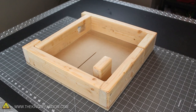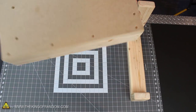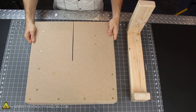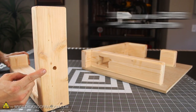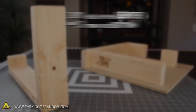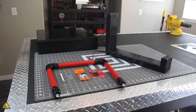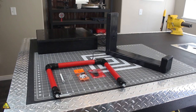Let's make sure all the wood pieces fit together snugly on the underside, then double check the base support assembly didn't get screwed on — that's important. We still have one thing left to do with the base support, and that's to drill a 3/8-inch hole directly in the center and 5 inches from the bottom. Just for looks, I decided to spray paint mine black so it would match my wire saw better, but however you color yours is completely up to you.